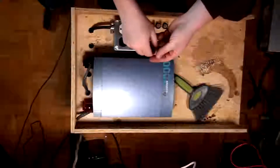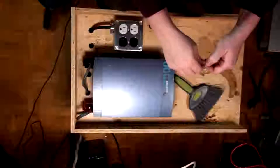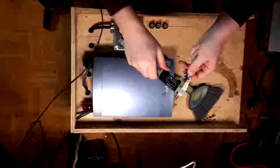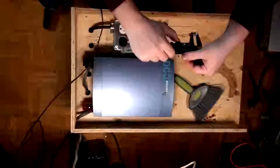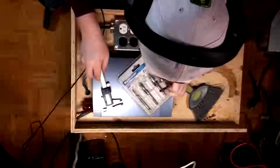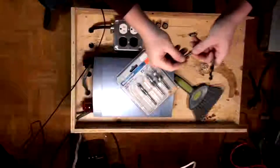Alright, so that's cool. We've got some neons here, so these will just be for the DC out, or the AC output working. Now let's figure out what size of a drill bit I need for these, and hopefully I've got an auger for that. What do I do with my caliper? Anybody see that? There it is. 0.340. Let's see here. I think that will be this one. Oh, maybe a bit smaller. Might have to actually bust out the drill bits. That's pretty close. Use this one.